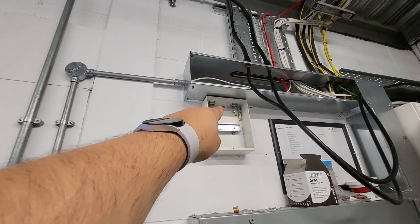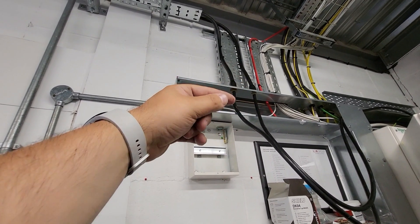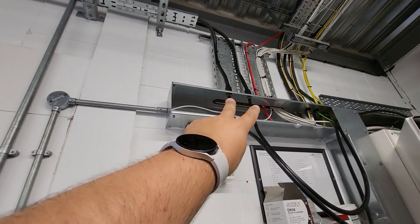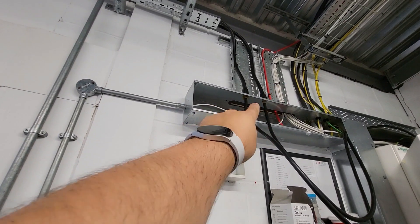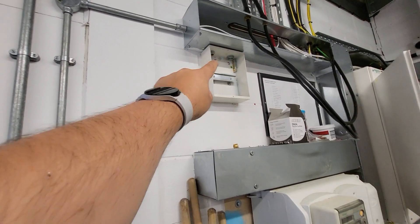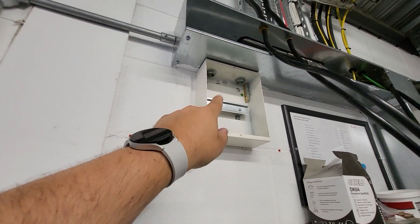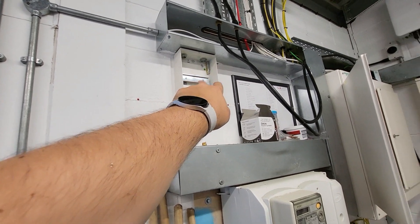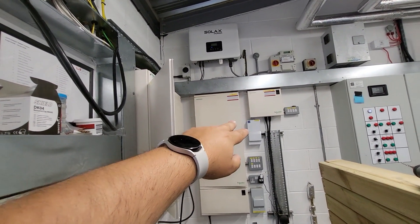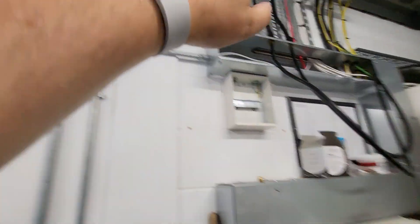Into this little distribution board here. There was a slotted entry to the trunking but Mike decided to come in front of it because he wanted to gland the armours off and make sure they're earthed down correctly with fly leads. He didn't have an earth nut for that one, so we're going to swap that. This is our board — we've got it coupled into the trunking, fixed to the wall, ready to go. This is the Proteus One, same principle as the last video: a couple of four-pole RCDs going in, fed out of this distribution board. We've got our C40 MCBs and a couple of RCDs out and away to the charge points outside.